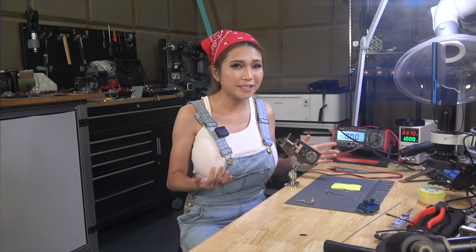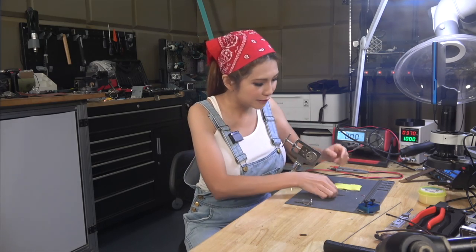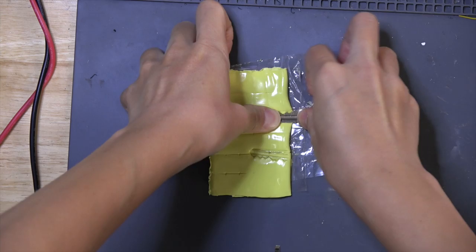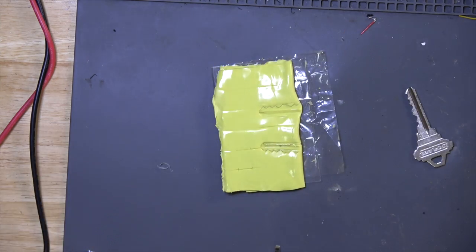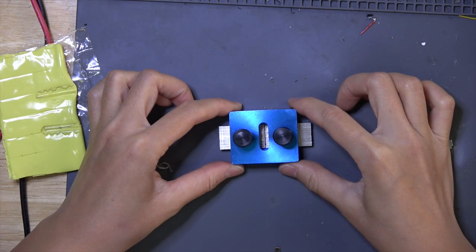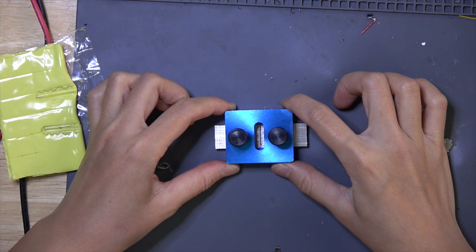Okay, so pulling the code off a photo or video is definitely hard mode and something I wanted to show first. If you have physical access to the key, you can also quickly press it onto putty. For measuring later, make sure you account for shrinkage or measure it directly with a pair of calipers. If you go the caliper route, these two can quickly give you the keyway profile.